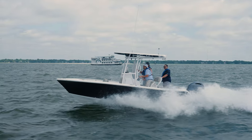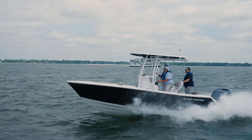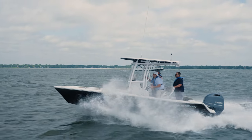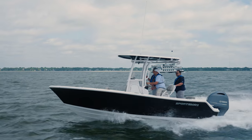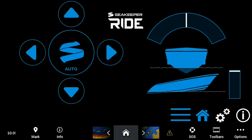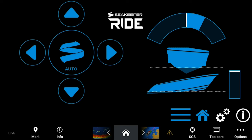When the system is in auto it's almost always going to keep the boat completely level when you're underway. There will be some instances where you want to override the auto mode and change the boat's attitude to the running conditions you're in. You do so by pressing the four buttons around the Seakeeper envelope. For example, to add a starboard list to the boat you're going to hit the right button. You can adjust the list with each tap, and on the screen there's actually the shape of a boat showing you what degree you're at.